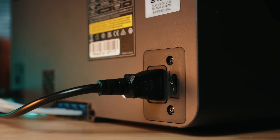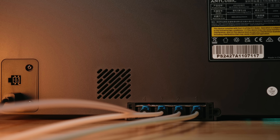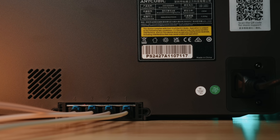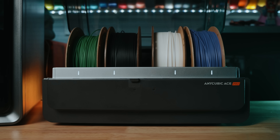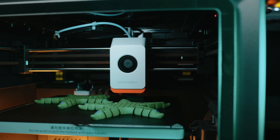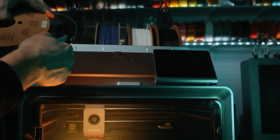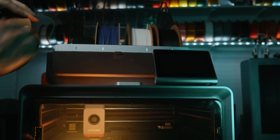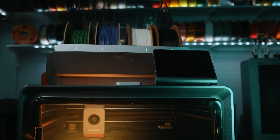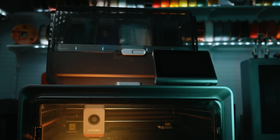Here's the clever part: the ACE units don't just feed filament — they dry it while they feed it. There's a second power plug, and at first I thought it was a terrible engineering design, but once I realized it was powering an active drying system during printing, that turned out to be a pretty cool feature. If you've ever had a roll of PETG or nylon sit out in humid air too long, you know why this matters. Picture printing an eight-color project that could take days, with each spool actively drying while the machine swaps between them — that's a serious workflow improvement. One heads up: you'll need to make sure you straighten the tip of your filament before loading. If there's any curl or kink, it might jam the loading system. You have to make sure it's straight — I've seen this on a couple of external multi-filament systems. Cut it nice and clean before loading.